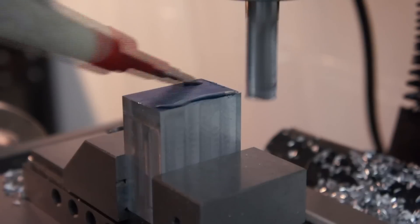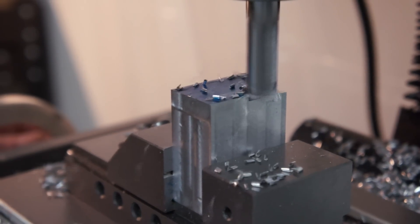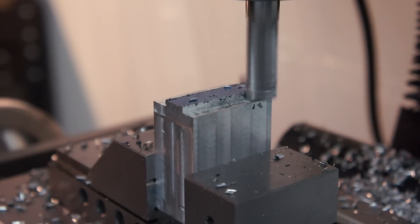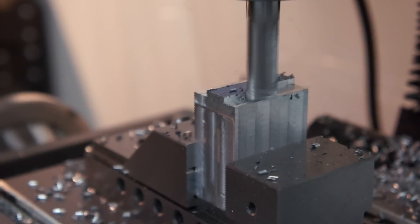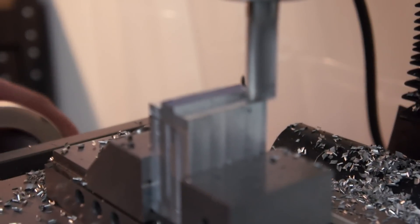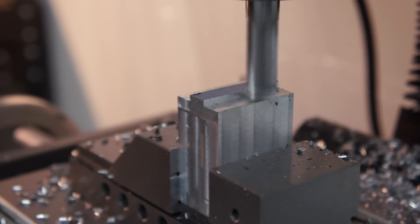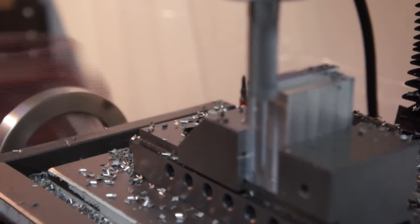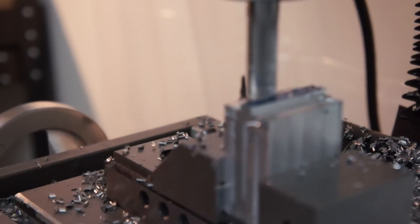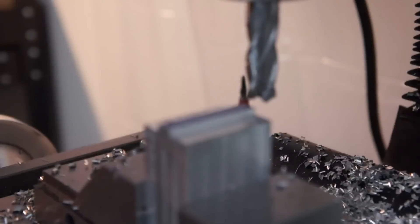Here I touched off on the corner and I'm milling the two edges down the center. This is going to align with the T-slot in the cross slide of the lathe, and it'll keep the block from rotating once the force is put on the knurling wheels. I just made it so it was a nice slip fit in the T-slot.